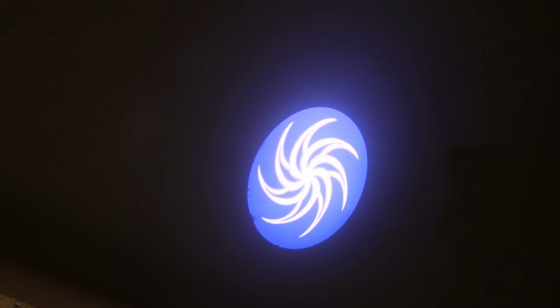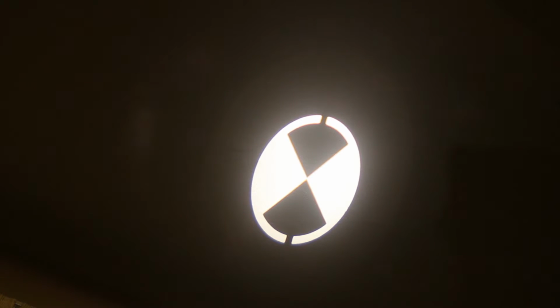The first channel is color. From the bottom it starts from white, then red, yellow, blue, green, magenta, cyan, orange, and then the last bit of the fader is the speed of fading between the colors, up to the top where it just goes crazy. The second fader is the gobo. It selects the gobo from open to the first gobo with no color added, to the second, third, fourth, fifth, sixth, seventh, and then the last bit, like with colors, is just a sweep through all the different gobos. I can leave it on this gobo.